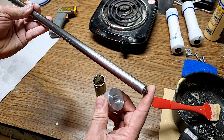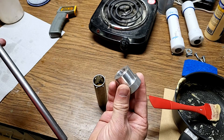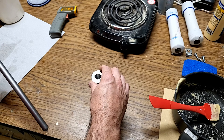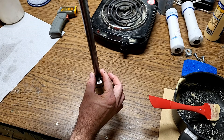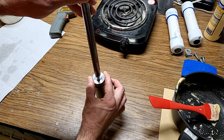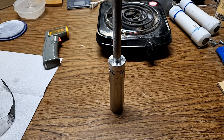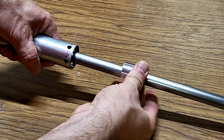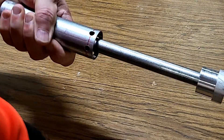I'm using a 5/8ths inch diameter steel coring rod and I built a little tool on the lathe just to help keep the rod straight as it's inserted into the motor. I'll let that cool for about half an hour and then I can pull out the coring rod and remove the core rod alignment tool and the core rod.